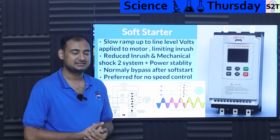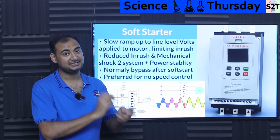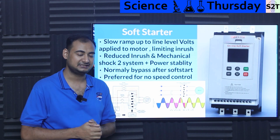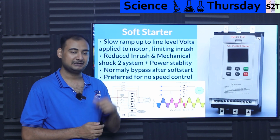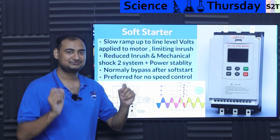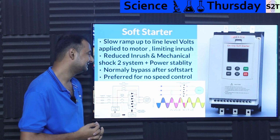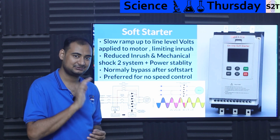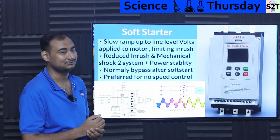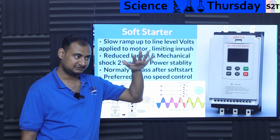Now, I have recently got solar, and this is completely isolated. It takes DC. Even from AC, it makes it DC. Then from the DC bus, I get a clean AC sine wave output. Whenever that refrigerator runs, I can feel it. Why? Because my UPS reacts, since for a few milliseconds the voltage dips. That's how much inrush there is. Again, I'm experimenting with NTC to tame it, and I'll share if it's good. So it removes the dip that happens.